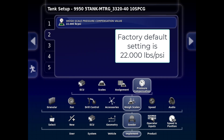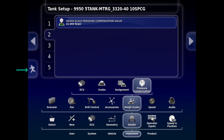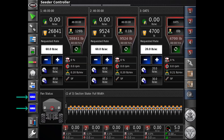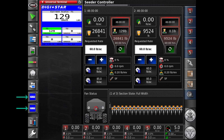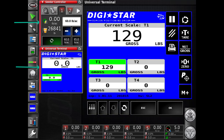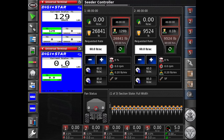We will now look at some of the functions we can access through the Universal Terminal. Touch on the Running Man to go back to the operating screen. On the left side, there should be one tab or two if you have a saddle tank — either black with a white border or blue around white. If you touch on one or both of those tabs, they will open in the mini view. Touch on the mini view to slide it out to the full view screen. For a five-tank system, there will be two tabs: one with tanks 1 to 4, and the other with tank 5.